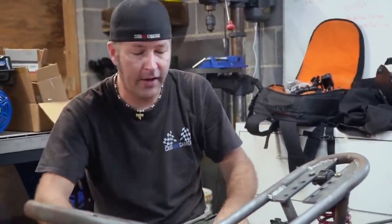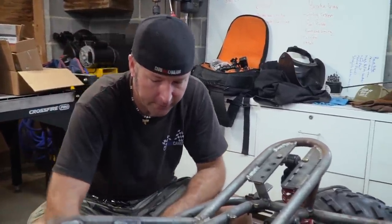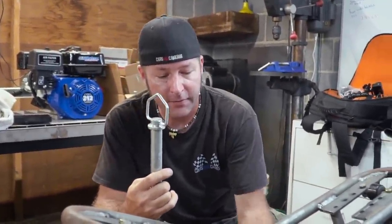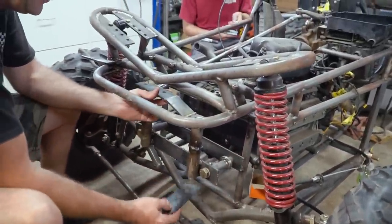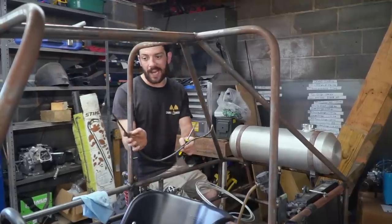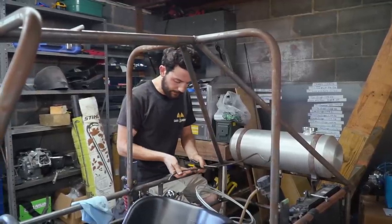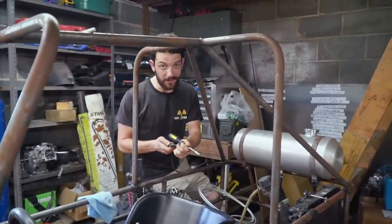What I've got going on here is I have a couple of tractor — I don't know what they are, but the piping fits perfect — on more tractor stuff. I'm using these pins to transfer this motion down to this motion right here. I need it to be sturdy, so I'm bracing things up so we can have a nice tight steering. Ike's been working on the front end, that's looking pretty good. Charles has the front brake lines all plumbed up — that's looking great. I bent up this fuel line, the hard line here, and Charles helped with the flaring on the ends. So all I need to do is plug it into our rubber fuel line and that'll be one step of the fuel system done.